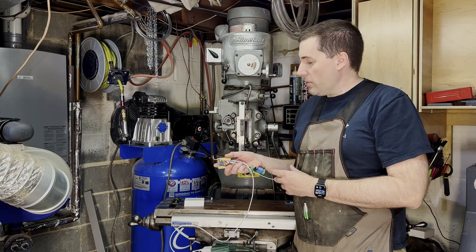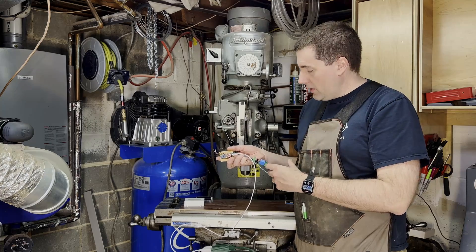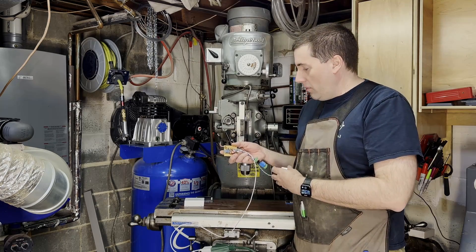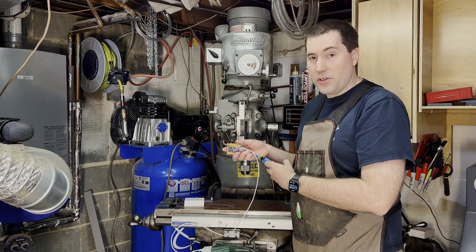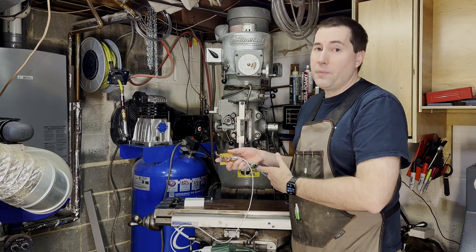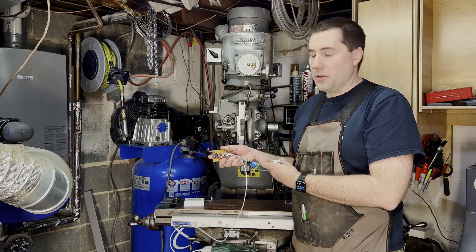I've got all that mess cleaned up off the breadboard. I've got it on a little protoboard all soldered up nicely. I've got the switch wired — I'll mount that separately — and then I've got the relay. It's not attached right now because I had to put it over by the switch. But you can see it's running — it runs off USB-C. You can see when I flip the switch, relay comes on, the light changes to let me know what's going on. And when I turn it on, about two hours later it'll turn itself off again. So I won't have to worry about forgetting to turn off the air compressor now.